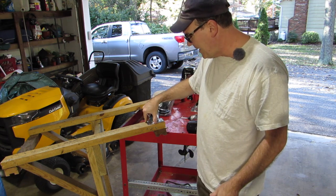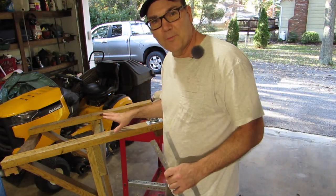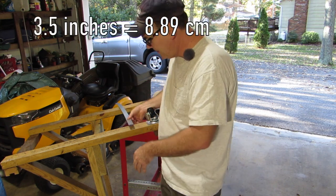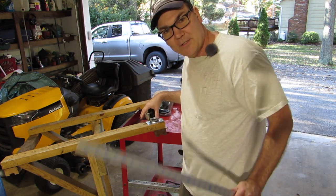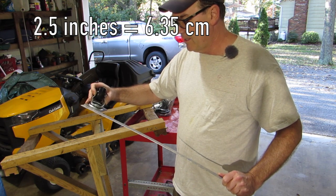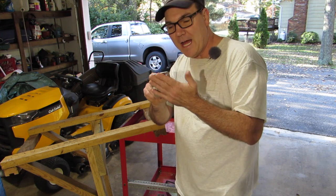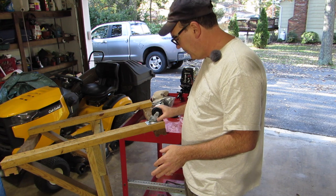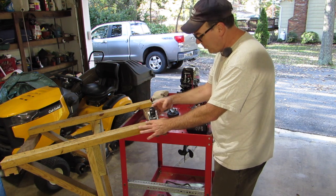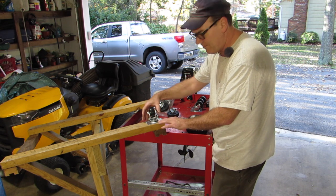You also want to make sure the plate isn't any larger than your 2x4 or 2x6 base. Since I built with 2x4s, my base is three and a half inches wide. The casters I linked in the video description have a two and a half inch wide base, just like the ones I have here, so they fit perfectly. We've established we need ones with a flat bolt-in base that we can screw directly to the 2x4 or 2x6, and we're going to put them on all four corners.